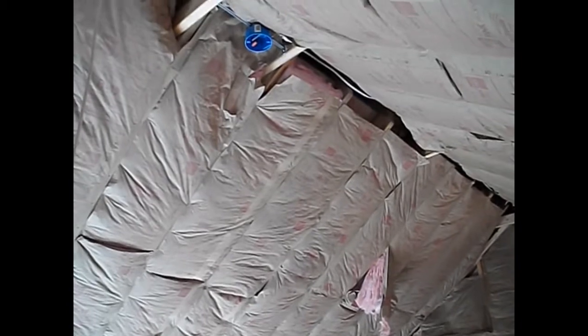And then I hung the ceiling fan box. That's the one with the braces on it, and it's got wire run to it. I pulled the wire a little bit short because I was standing over here. I had the scaffold going the other direction, but it didn't reach all the way over because I was pulling the wire up. I didn't push enough wire through there, but that's okay. It's a junction box, so I can put pigtails in there to connect the ceiling fan and light.